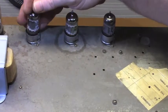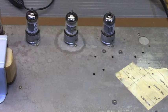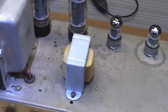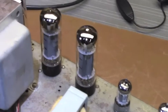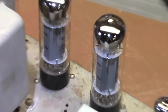Now, the old power tubes, which were misbehaving, and I think mainly they were misbehaving because they just could not handle the B+. It looks like they're a quad of Westinghouse Great Britain 6CA7s, and they may be just fine in another amp. But this one is sending out whack loads of B+. So I've opted for one of the few non-JJ tubes that I really dig. These Svetlana EL34s are just absolutely fantastic.